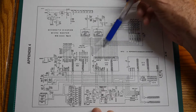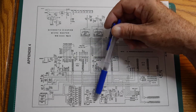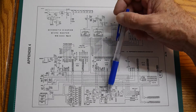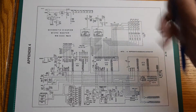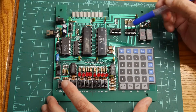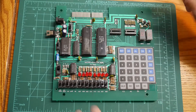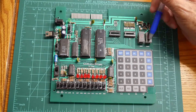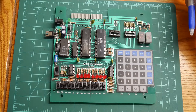Using Ports A and B to scan the keyboard. Yeah, it looks pretty fun. There's a little flip-flop here for TIM — maybe that's for single-stepping things. Timer in — that's for clocking the timer, so you can individually clock it. I do believe I have all of the parts. These here are just connectors for additional I/O circuitry — I don't think they're necessary to actually run. These are kind of strange parts — LTS 3112, or 312 — a strange part number, but I don't believe I need those chips to make this thing run. So that's good.